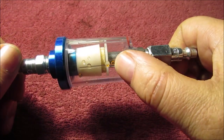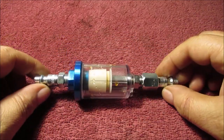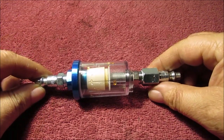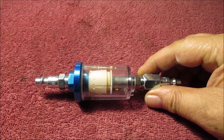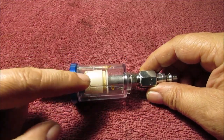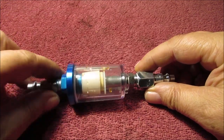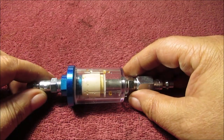That's got a little rust in there, plus there's some oil I noticed. We're going to pause, and when I come back, I'll have this fired up with the hose hooked here coming from the air compressor, pushing it over to the air tank, reserve tank. I'm going to try not to let pressure go backwards in here. So what I'll do is, the tank is empty, so I'll have it hooked up. I'll clip this on and we'll be filling the tank before I start filming.